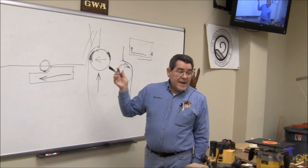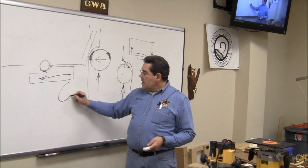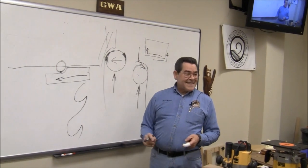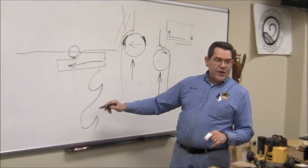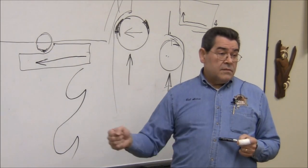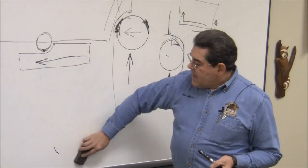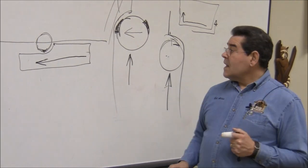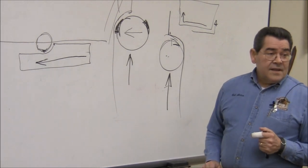Not a whole lot you can do about grain. One of the pieces I was doing was some flute racks for a friend — I needed to cut a shape like this, and I just used a round-over on these edges with light cuts, because I'm going to hit the grain from every possible direction doing that. Same thing if you go around a circle. If you have a really bad grain situation, a climb cut is only preferable if you take a real shallow cut.